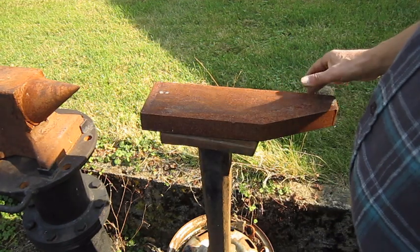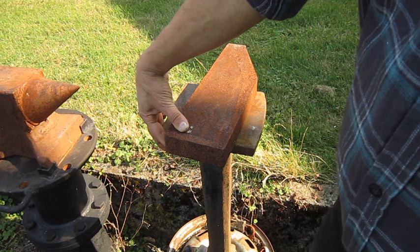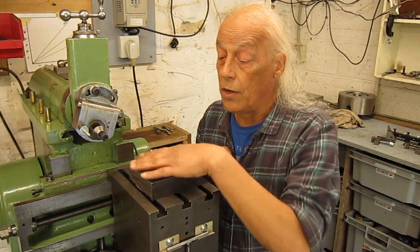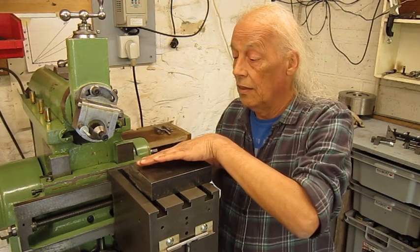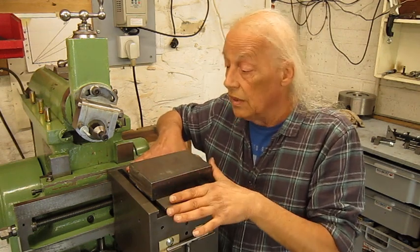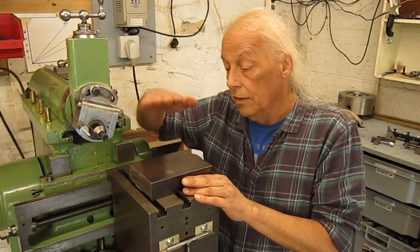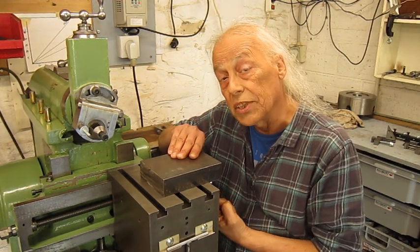I think I found the right piece — it's a bit over 110 millimeters, 40 millimeters thick, and way too long. I'm going to clean up the rough stuff and cut it to length. Normally you start on the top surface, flip it 180 degrees, and then with a good reference surface flat on the table you square up and work to size the four sides. Then as a finish you do the last big surface, which will be perfectly parallel to the already finished bottom surface.